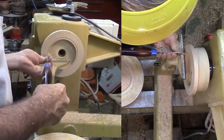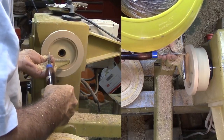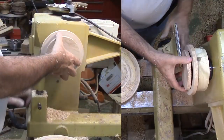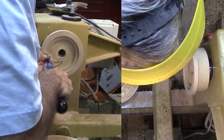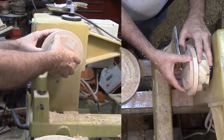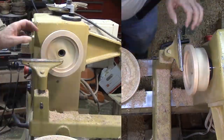Now to carefully cut the mortise. Since I've already cut the tenon portion, I cannot afford to overshoot the mortise size. Finally, glue the plywood into the mortise. Unfortunately, this is the top side and I'm going to have to reverse the wood and glue it into another faceplate so I can build rings from the other direction. I probably should have rethought the whole sequence.